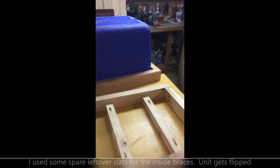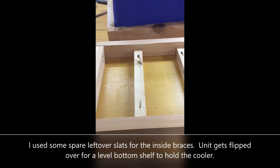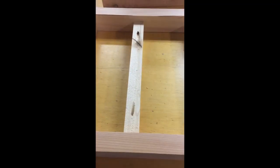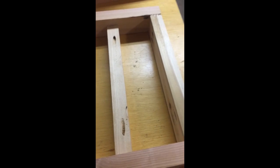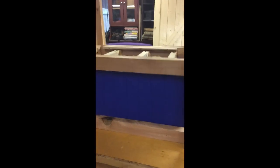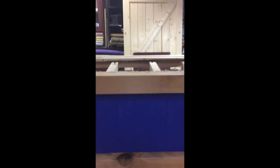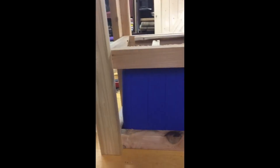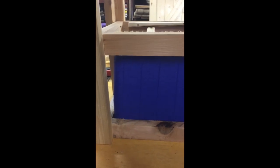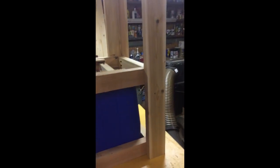I've been putting the frames together. The top one's already together and the cooler is flipped upside down on it. This will be the bottom frame for the cooler — same dimensions as the top. I cut some slats to put in the middle to support the bottom and the weight of the cooler, keeping it from falling through. I've done pocket holes here again. With the legs, top, and bottom all assembled, that's kind of how it'll look upside down.